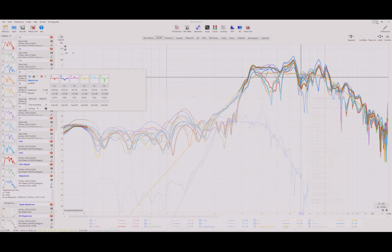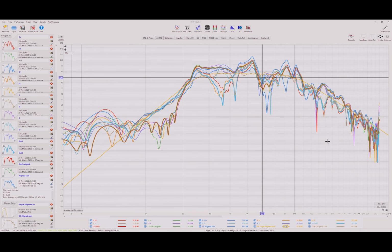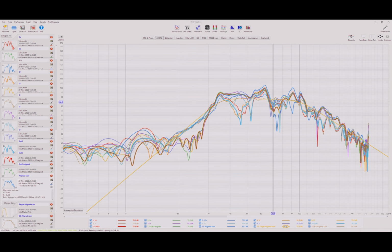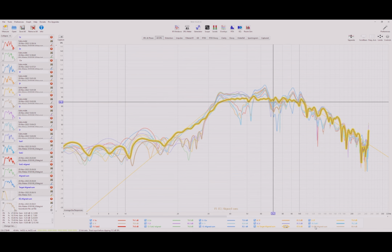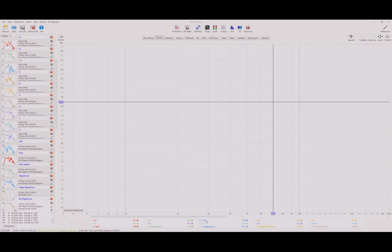So once you have those, when you apply these equalization filters to your subwoofer, you can even use your AVR if it's capable of equalizing subwoofer. This is what you're going to be getting. No, sorry, this is the align sum, EQ align sum. Yeah, this is what you're going to be getting. So, to compare, you remember you had measured your subwoofers together at the original listening position, this one, and now at the original listening position, this is what you'll be getting.